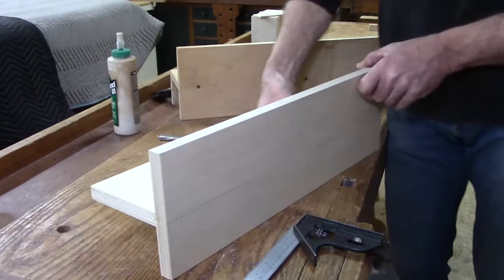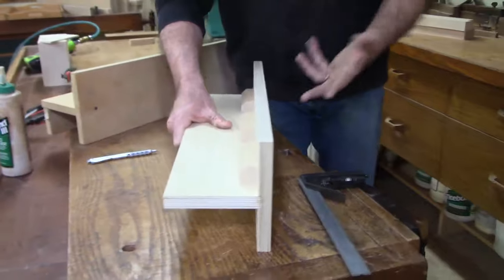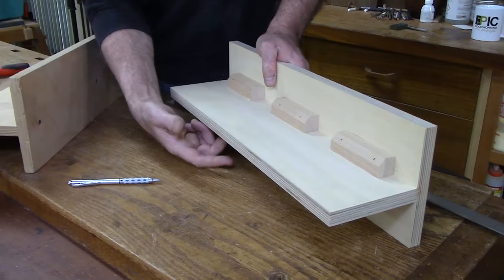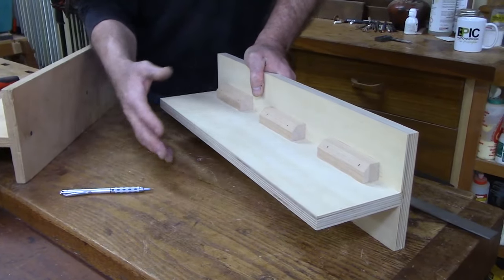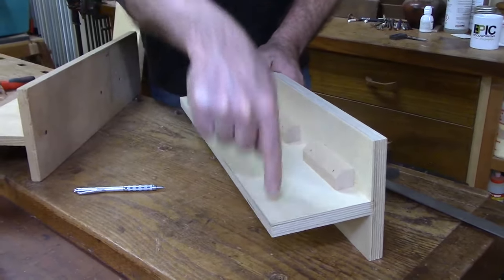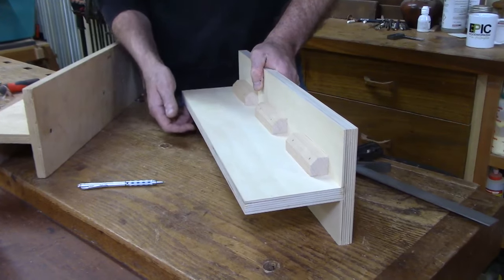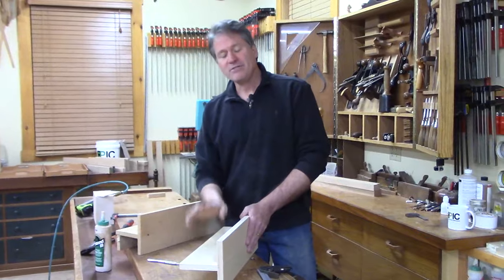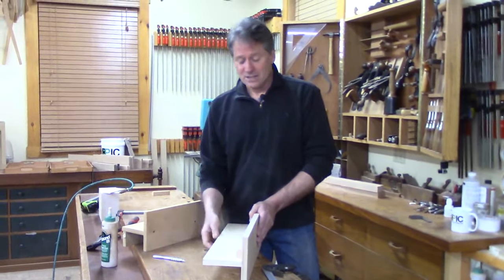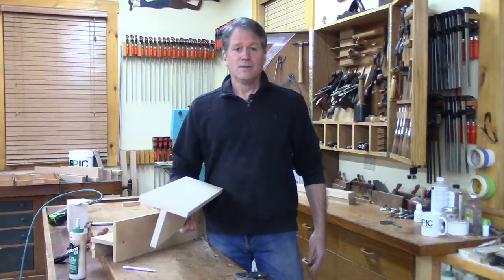All right, so there we go. We've got a nice right angle in here. This jig already feels substantial and true. Now, the last piece is that support piece, and we're going to fit that on there at the table saw because we're going to put a little pressure so it squeezes against the fence, and we're just going to nail down through. In this case, it's just a butt joint, and normally you'd put some glue on there, but I have to use this on another fence that's going to be a little different width. So I want to be able to pull that off. I'll clean those off, and I'll just adjust that fence on my potentially new saw.